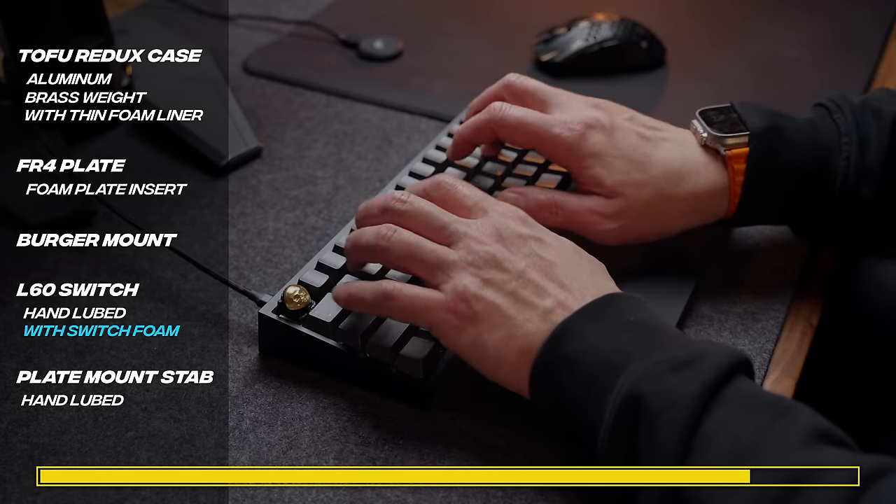Up until now, I've been mounting these builds using the burger mount — that's where you take two silicone rings, one on top of the PCB and one underneath, with the screw going through. This prevents that assembly from making direct contact with the case. Now with the polycarb plate kit and the new module, Wooting includes little dampeners that achieve the same effect. But I have seen people mounting this board with a gummy O-ring, and I did find one at Ringer Keys that'll work — I'll link that in the description because this is the way. This basically compression-fits the assembly down into the case, and it makes for a better sound, a better feel, and the most consistent space bar I've heard yet if you're running the OG Wooting 60HE.